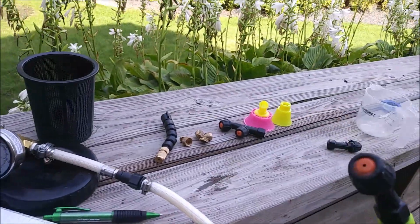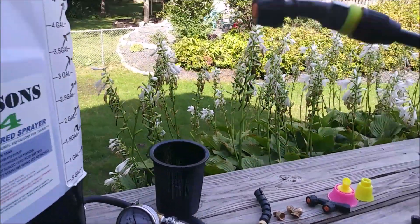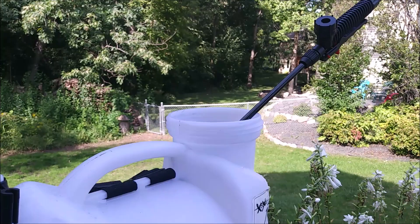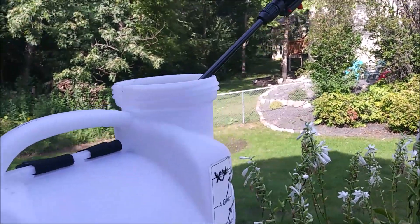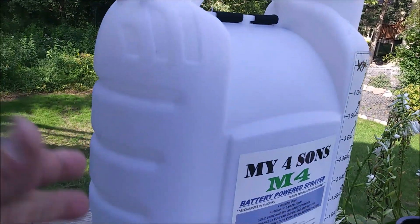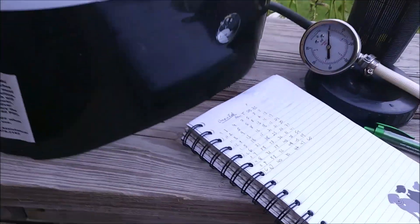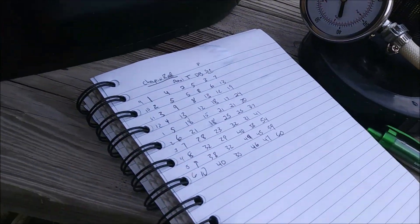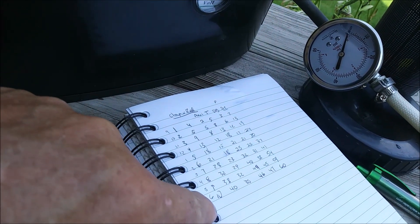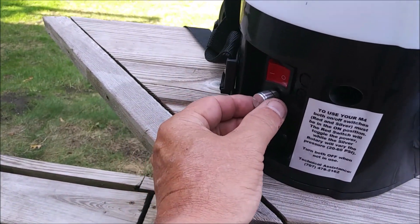I just put in one of the tips — here's a single plastic cone tip. I'm going to put it in the sprayer so any of the excess comes out. I've got the handle on trigger lock by spraying into the thing, so I don't have to refill this during the testing and it doesn't affect the results. I've got a little sheet of paper here for nine o'clock, ten, all the way up to six o'clock position, and I just measure on the meter here each time I adjust this.